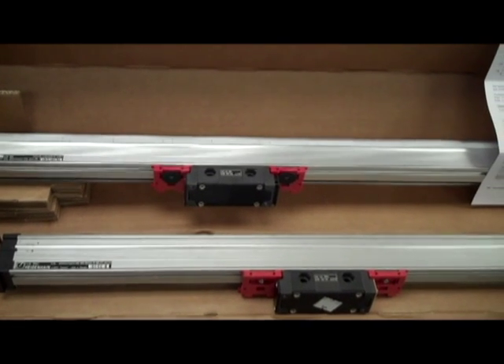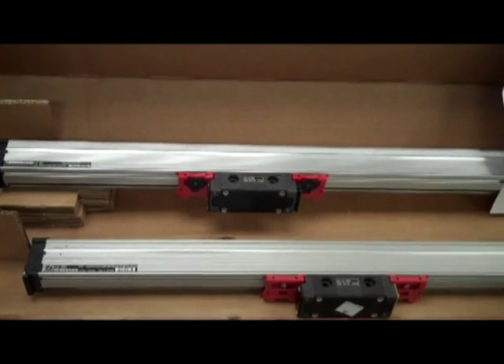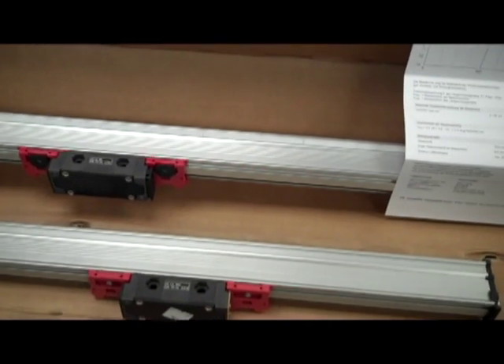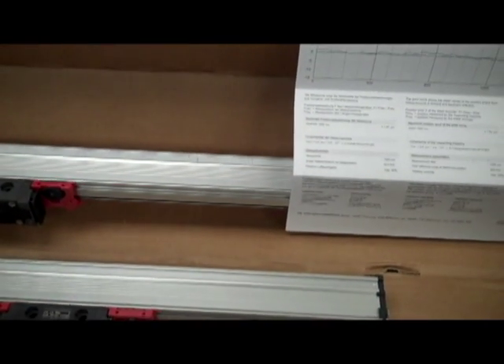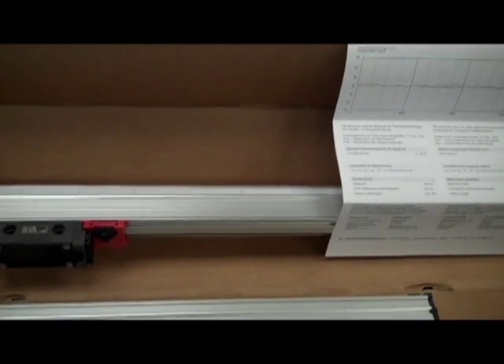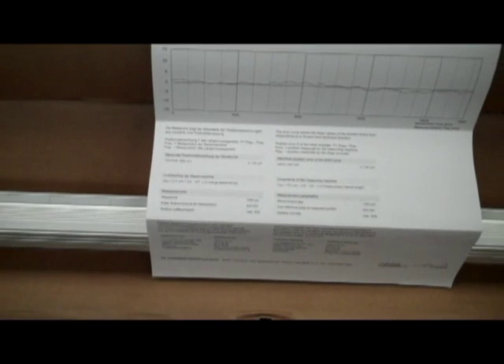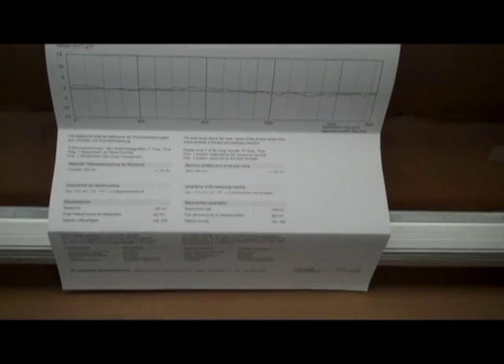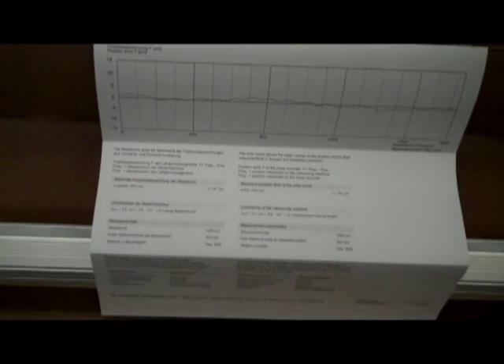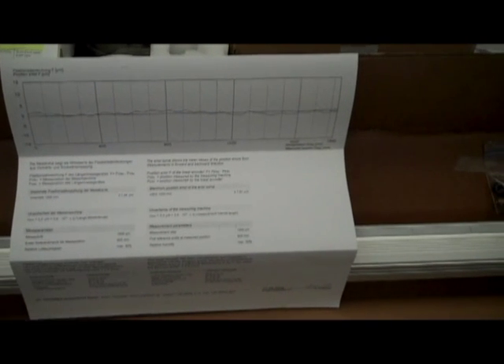This scale is 1840 millimeters, which is 1.8 meters. At a 5 micron accuracy grade, we would expect this to be somewhere between 7 and 9 microns accuracy over the full length. Heidenhain always over-specifies the error possibility in the scale, and in this case they really over-estimated — this one came in at a plus or minus 1.94 microns total over the full length.